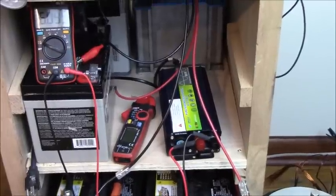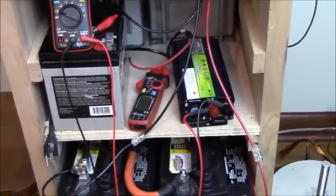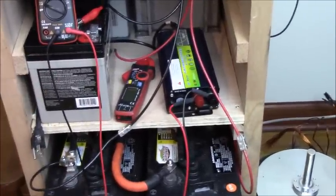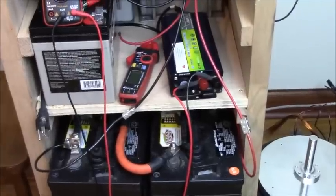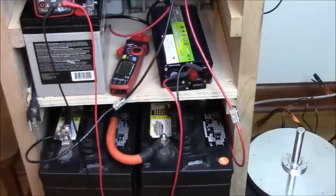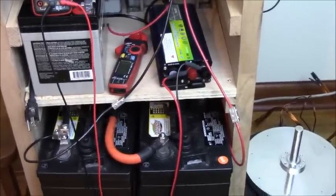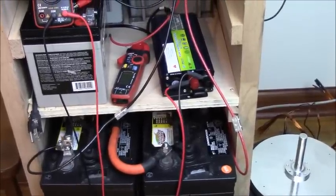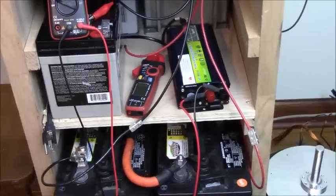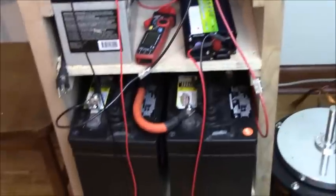And so what happens is you do that, and then you run a load, like say you do that on your input battery, which is what I would be doing instead of the opposite of what I was showing. But if I was to even do it this way, the battery would be bouncing back naturally, and I would say, wow, look at the charging rate. I'm charging 800 amp hours of batteries, and look at the voltage rise so fast. That's like a real gain, like, wow, what an over unity system. And how many videos have we all seen where people are playing that game?